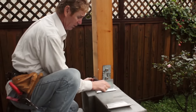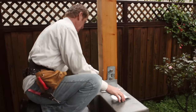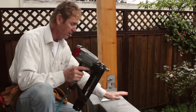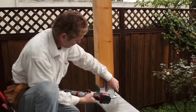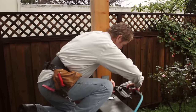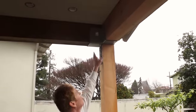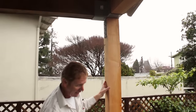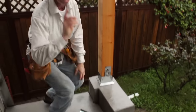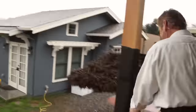We take the moist stop and go around the flashing. These guys here — weeps or drip screed, they mean the exact same thing — we'll place them around the whole perimeter. That way it protects the bottom of the wall, because you can't have the rain coming down here, going through, and rotting out the bottom of the wood. Always wear glasses, guys — you see how many strong ties we have here. If you hit one, the staple would hit you in the face. Have I almost lost an eye? You betcha.